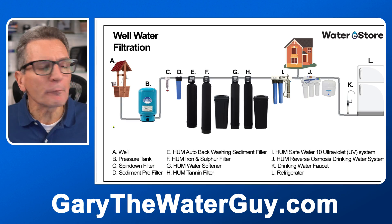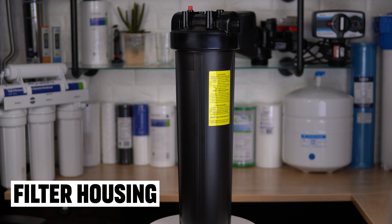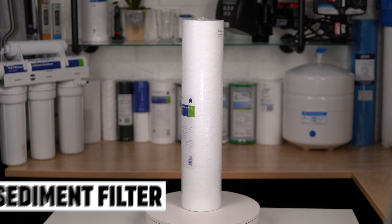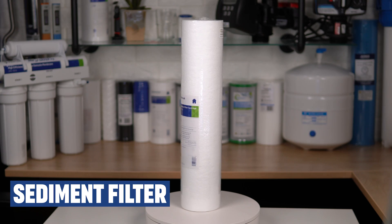This is a manual process so you'll need to remember to flush it out — it's definitely not an automatic system. Next up we have a filter housing with a sediment filter inside. If the dirt amount isn't too bad, which is usually the case with a well, you would use one of these to pre-filter your water before any filtration equipment like an iron filter or water softener to protect that equipment. The filter element will need to be changed at least once a year, or sooner if your water flow slows down.